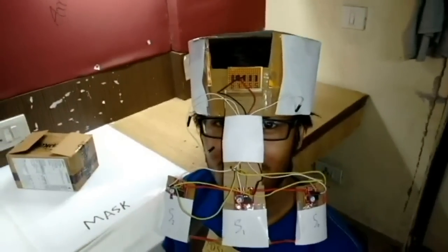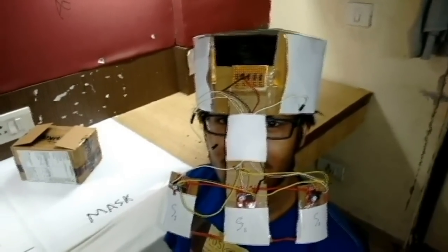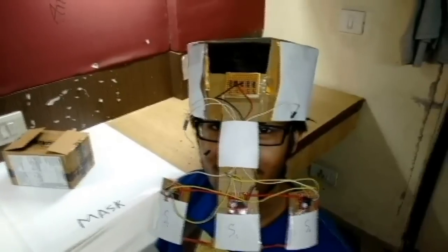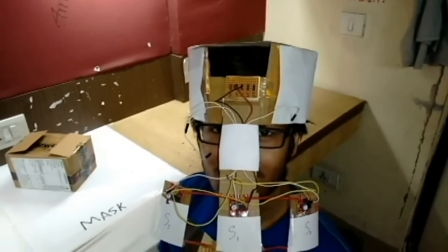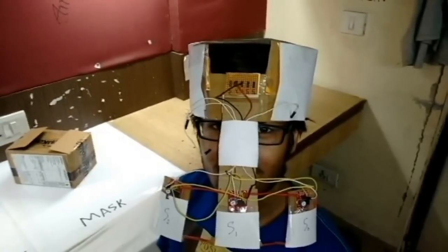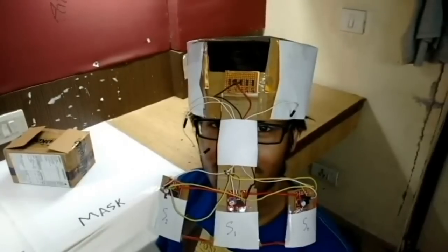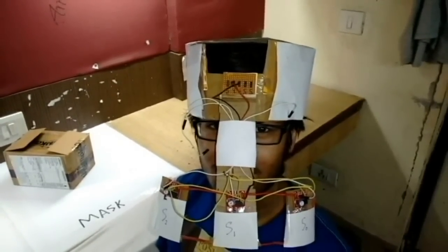For example, if a sensor is kept in front of our lips and its distance is kept sufficient to reflect no light to the sensor, and if we want to send some signal to the controller, we have to move our lips a little forward so that the IR sensor senses a surface and sends a high signal to the controller. Similarly, a set of signals can be generated by this sensor mask and sent to the controller for further conditioning and processing.